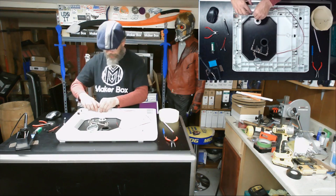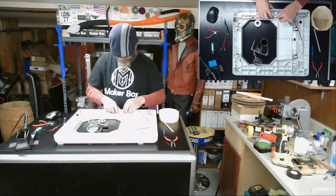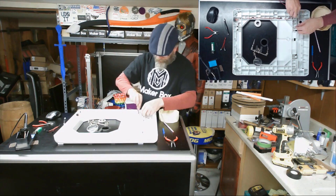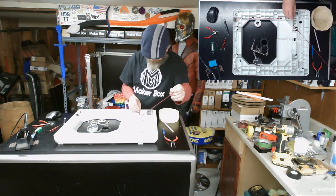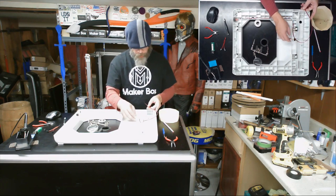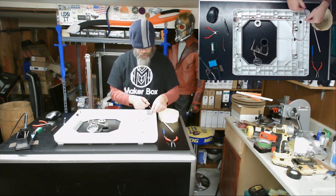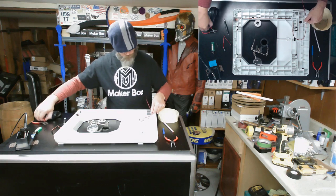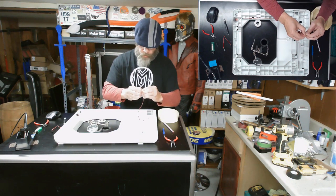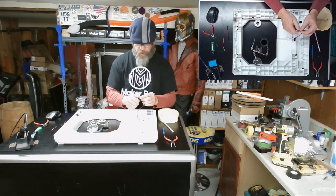Tuck it through this area — you've got these little hook-down tabs, try and get it down under those. You've got to go down under to get to this one hole here. Now we've got our wire fed all the way through. We don't need all this length because we do have a connector here and we're also going to have a connector on the other end. I usually just move it back to about that hole, cut the end off, strip these wires down, tin them, and solder our connector on.